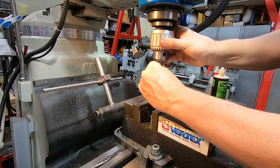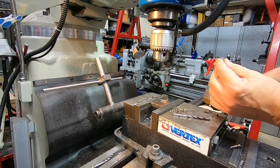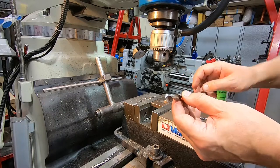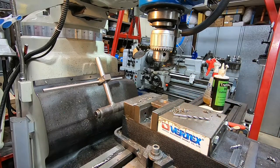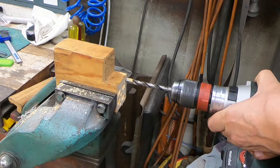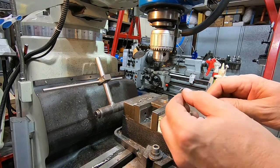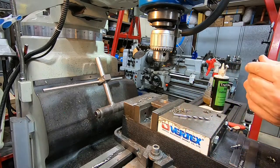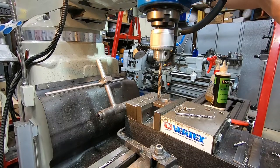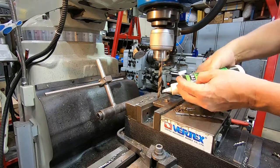Actually those lips are very sharp — I might just hone them. I'm drilling into the end grain of a block of wood just to polish the rough bits off. It doesn't put any stress on and polishes the edge — it's a tip my dad gave me years ago. Yes, that feels better — they just feel like knives now, they're quite smooth. I actually cut myself. So we'll set the speed down to a couple of hundred, a bit of cutting fluid, let's see how that goes.